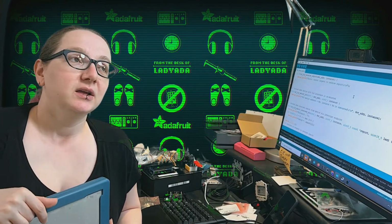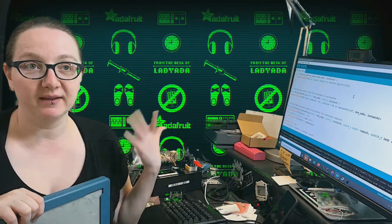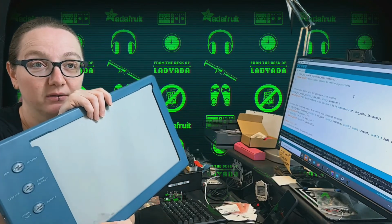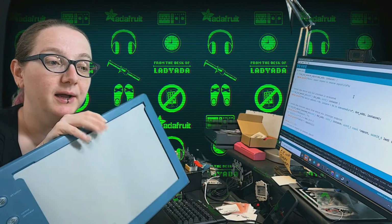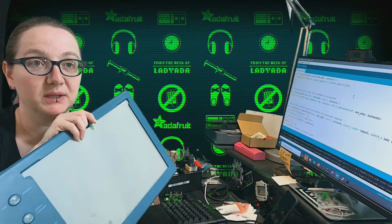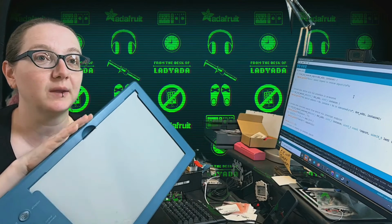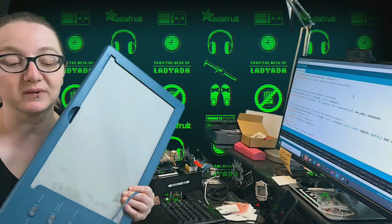On one hand, this is kind of cool if you want firmware that's constantly updating because the new driver has the new firmware. But the downside is it doesn't act like an HID keyboard. This isn't a standard keyboard because it needs to have that firmware downloaded to it. On a Windows computer, it's not too big of a deal because the company no longer makes these, but they open sourced the driver, so you can recompile it for Windows 10. But if you're on Android or Chrome or iOS, you're out of luck because there's no Cypress EZ-USB firmware downloader for iOS, and there never will be because Cypress doesn't support this stuff anymore.